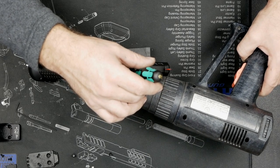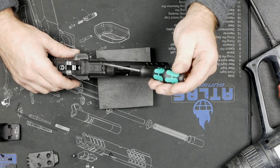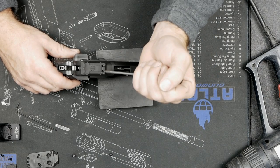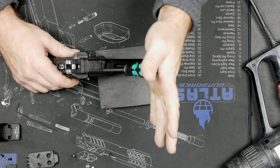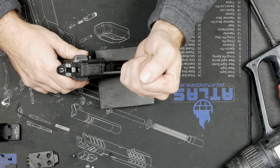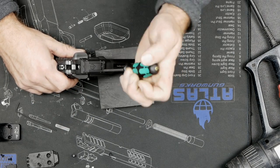So that's your level three. Level one is just putting firm pressure on the top of the screw and turning — that one went. Level two is putting some heat on first and then turning. Level three is applying that turning pressure while someone else simultaneously applies heat, and eventually they'll turn.